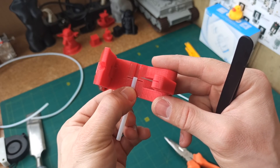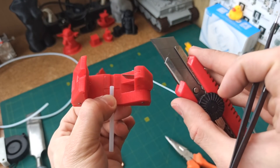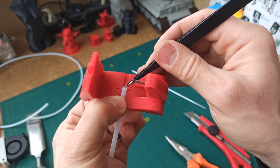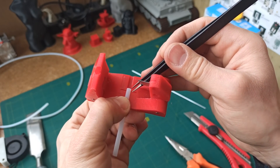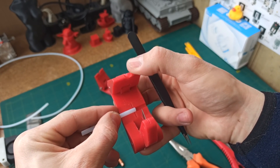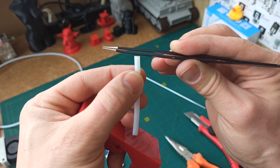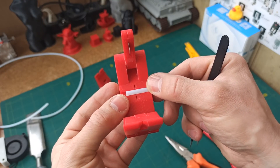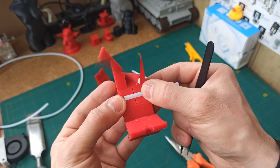Why is this? Very simply: when the tube is right at the edge, pressure occurs because the stationery knife has a double-sided edge. The shorter portion of the teflon deflects more, the longer portion deflects less, and as a result you don't get a 90-degree angle. For example, look — there is a slight incline. Therefore, the teflon tube must be inserted into the device as far as possible, and then the cut will be maximally precise and correct.